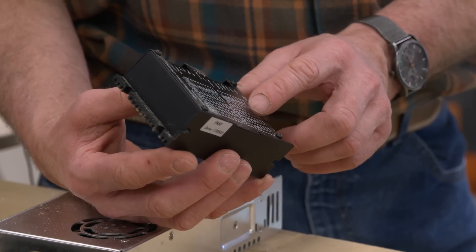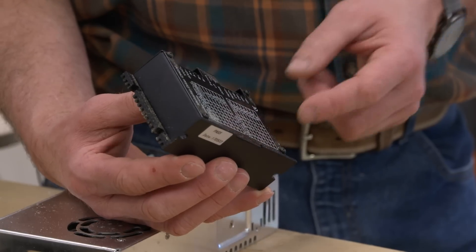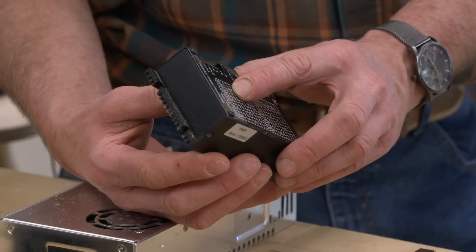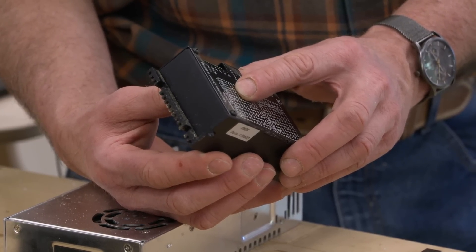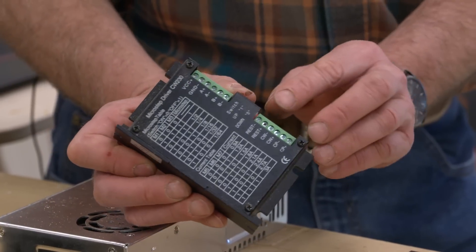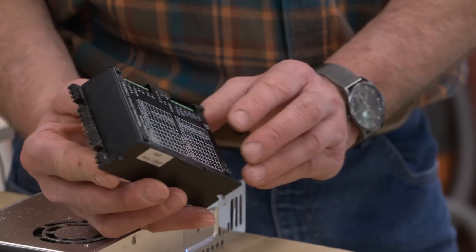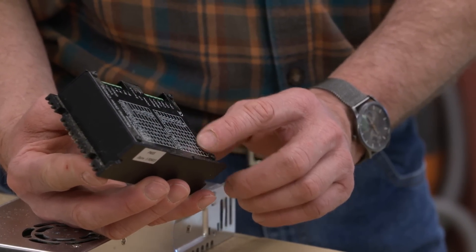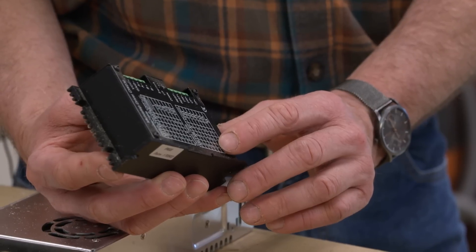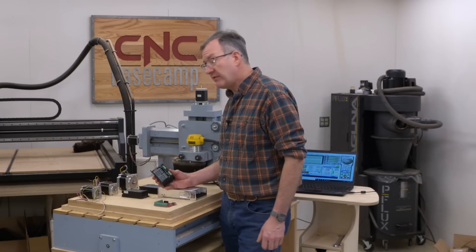The lower chart has to do with the amperage that our motor is going to draw. So we set up the switches to accommodate the microstepping, and we set up the switches to accommodate the amperage draw. Hypothetically, if I wanted to set up a one-half step — dividing those 200 steps into 400 — I would set the switches at on, off, off. To set the amperage at 2.4 amps, switches five, six, and seven are set at off, on, off. It's pretty simple to set up your driver for the motor configuration you want.